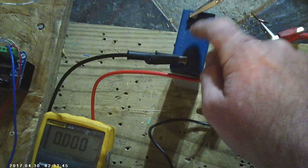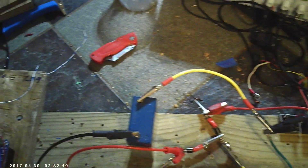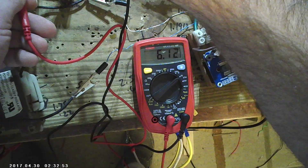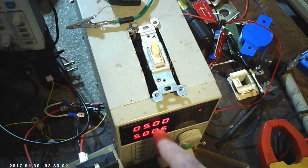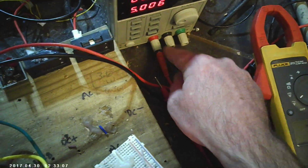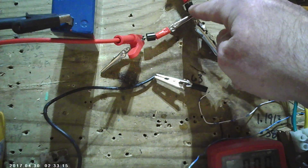This is a six volt battery — six volts. I'm going to prove it. It's actually pretty full because I've been charging it; it's at 6.12 volts as you see. The power supply is going to stay at five volts, and we're going to put the multimeter on there. Five volts is coming out of the red, five volts goes through a diode.